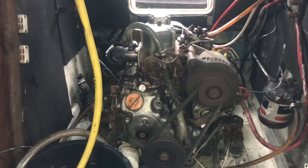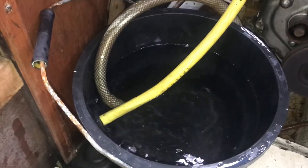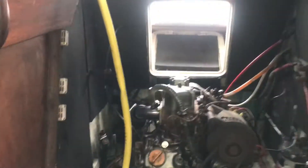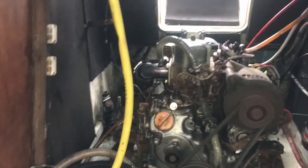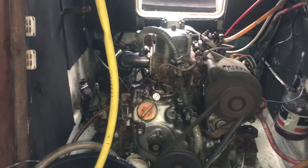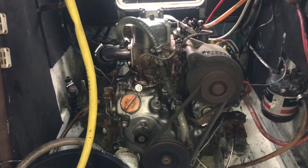She's going to suck water out of the bucket — digging out the back. I wait for the engine to warm up so the thermostat's up to temperature and we've got warm water flowing through it. Then I'll get rid of the hose and throw some antifreeze into the bucket. Now it's sucked up through the engine and out the back, and she's ready for the winter.